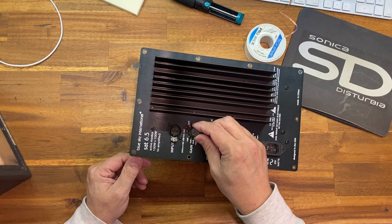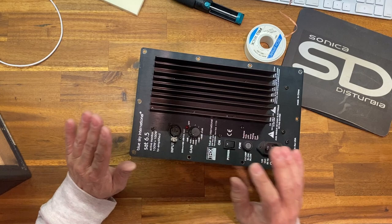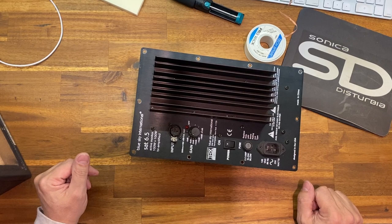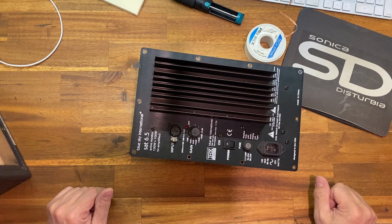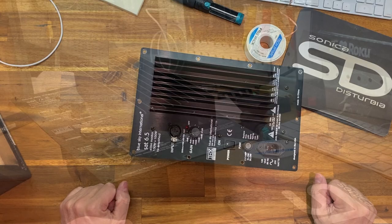I do have them at about a -3. The two near fields are at about a -3 dB, because my midfield setup with the two 6.5s and the subwoofer, they're back a little farther, and it just matches so that when I'm going through A and B, the volume doesn't jump. So I can kind of reference the bass real quick, go into the midfields, and then go back to the near fields and continue monitoring.